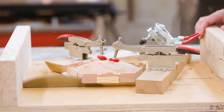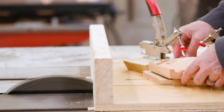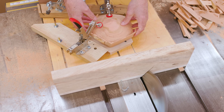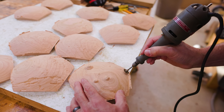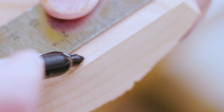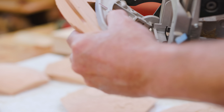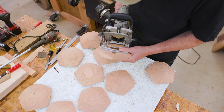What I didn't realize is that I had set my first cut where the terrain was low on the Martian sphere, so it made a clean edge. Whereas where the terrain is higher, it didn't quite cut at the center and I ended up with a little extra piece — but it looks bigger than it is. Where it's actually connecting to the sphere, it's very thin. I found a little saw attachment for my angle grinder and I could use that to clean up those cuts. Then I wanted to add a biscuit at each of the seams, so I found the center on each of the sides of the pentagons and cut the slots for the biscuits by hand with the biscuit cutter.